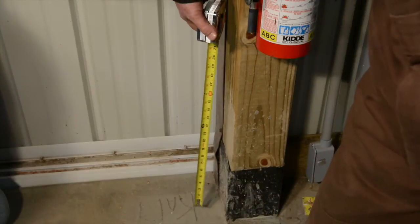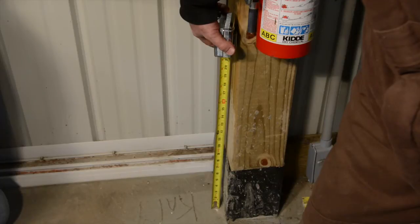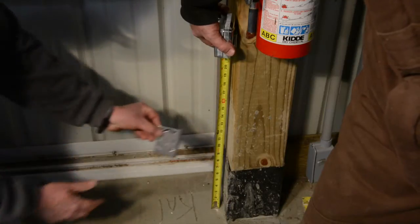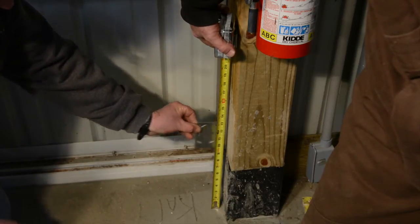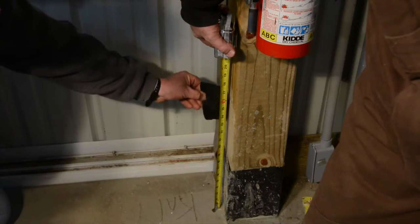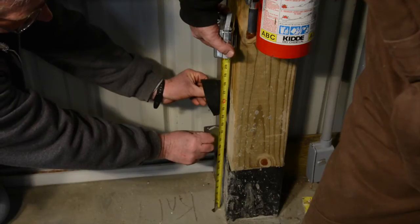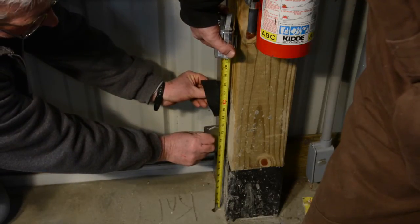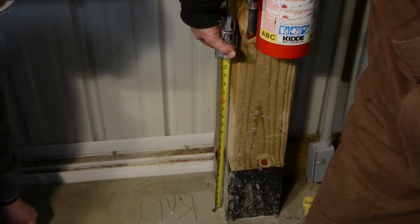What we want to do is measure vertically, and in this case we're going to put the transmitter receiver at 9 inches off the ground and onto the jamb. And since we are already here, we're going to go ahead and put the reflector for the other side at 12 inches. Or is that, 12 or 14 inches it looks like. And then we'll be ready and we can do both of those on the other side at the same time.